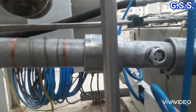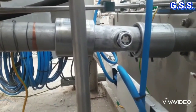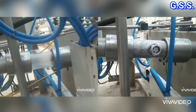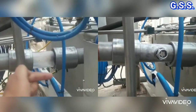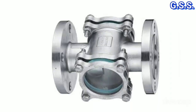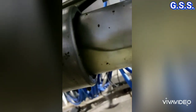This sight glass assembly has been installed on the lube oil line with strap grip coupling after removing the earlier sight glass. You can now see both the earlier and the modified sight glass installations on the lube oil line side by side. For any oil line, we should not use any bare non-conductive sight glass — we should use a sight glass with metal housing for electrical continuity.